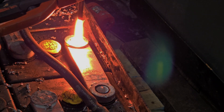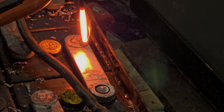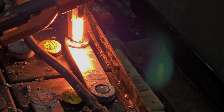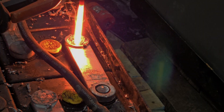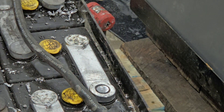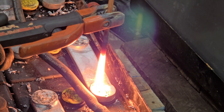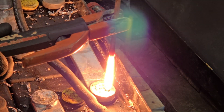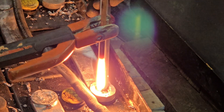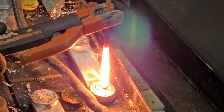There's a little bit of contamination that got in there — I'm trying to flick it out. You can kind of see how when I pull that rod away there's a pool of liquid lead in the middle. It's a little easier to see on this one. As I'm melting down that post, you can see I'm angling the stick towards the walls of the intercell connector. You don't want to melt through the intercell connector because you'll lose your pool — it'll flow outside of it. I'm trying to melt into the side of the intercell connector to make sure I have a nice bond all the way through.